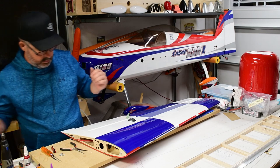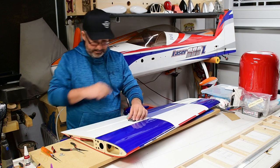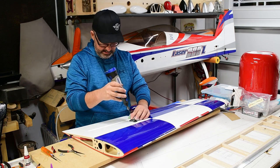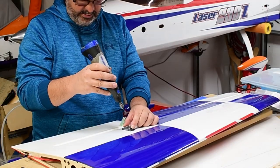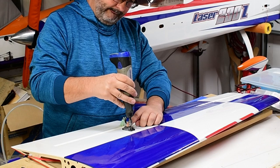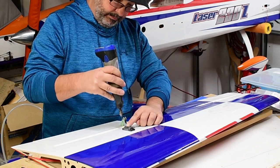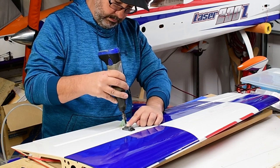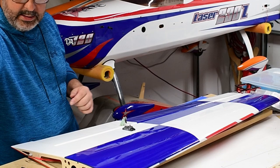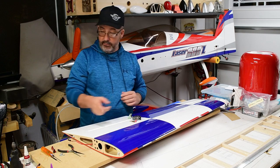Set that aside. Now we've got our wire pulled through, routed how we want it, and our servo in nice and neat. Next step - take our Dremel tool, just like we've done before. We'll center the servo up. These slots are pretty tight so it's not going to go very far, but I like to hold it down with one finger and always run the 1/16-inch bit through all the mounting holes. Once we're done with that, we set our Dremel aside, pop this out keeping the wire over here, blow off any dust, and now we've got four nice and neat holes.